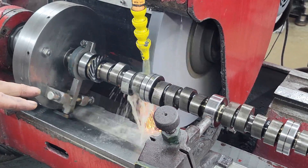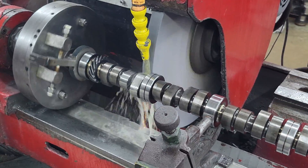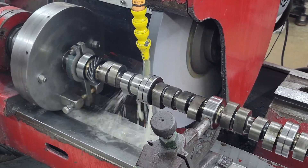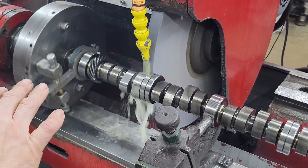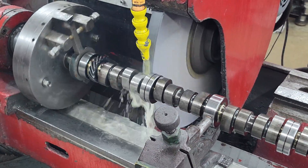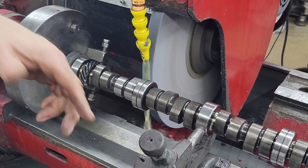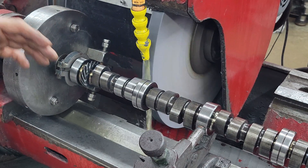You can see the core is really rough, but it looks like a lobe. The industry calls them semi-finished, or UGL — unground lobe cores. The core comes from the core manufacturer just like you see it. All the journals are ground to finish size, it's heat treated, and when we buy them, we buy cores just like you buy finished cams. This one is 240 at 50 with a given lobe lift, and we try to buy a core as close to the finished cam as possible.